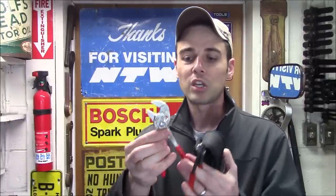The pliers wrench features flat jaws that close in parallel with each other. They're going to be able to not only straighten out sheet metal, but push in bushings, and give you an extreme amount of clamping force — a 10 to 1 ratio. The Cobras, on the other hand, have extreme grip, so we're actually going to try this out on the Cobra test stand to see if it's going to hold up my weight or slip.